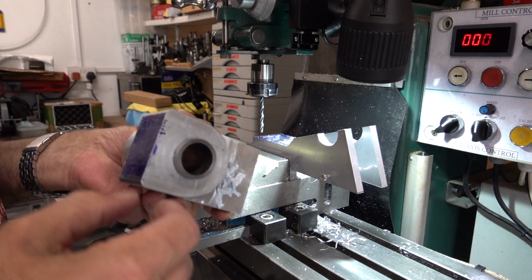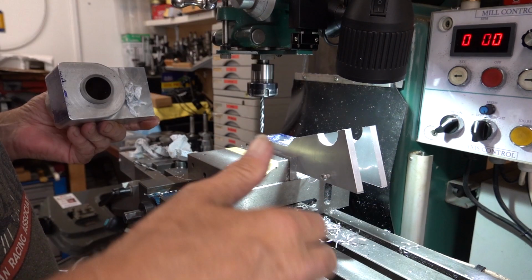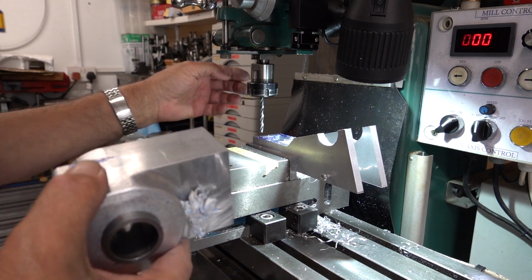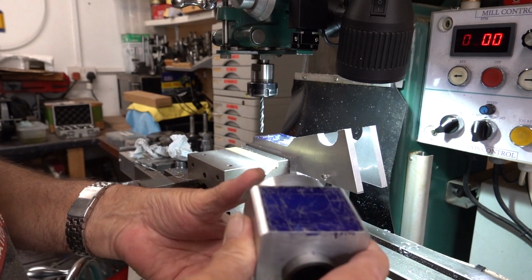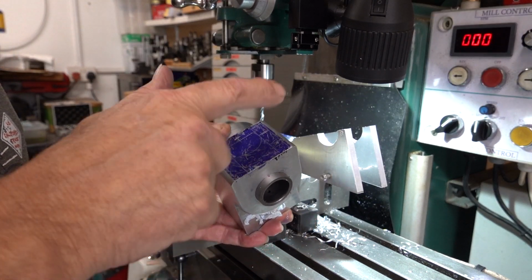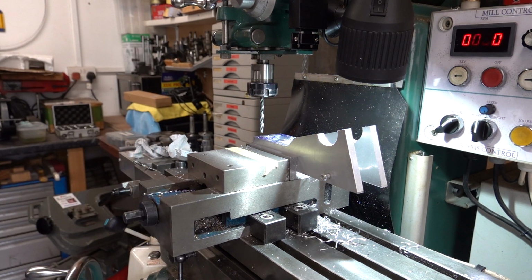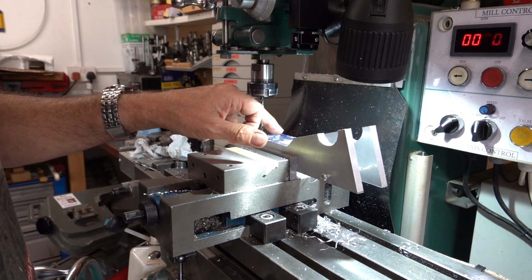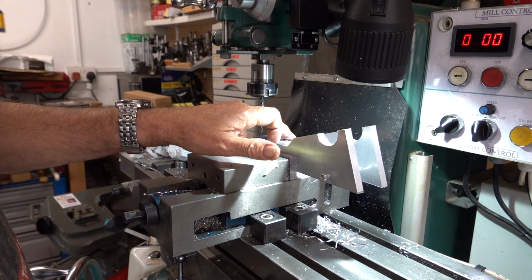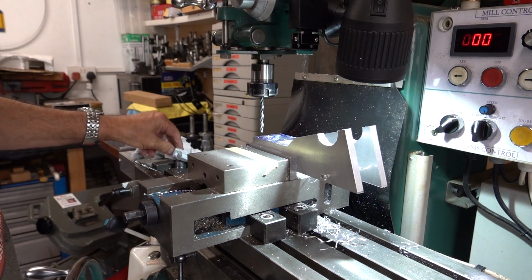So I decided to drill the framework first. I can transfer that over onto the big base, and I can bore that through easily by just using either a dowel pin or this drill to follow through. And then I've got to transfer those holes into here at 4.2 to tap for the M5 bolts. So I've already drilled quite a few of the holes. As I said before, one of these dividers I put in was sat a bit high, so today I've run a milling cutter over so they're all flat, so the body sits nice and flat on it, the cylinder.